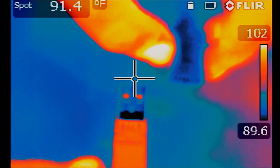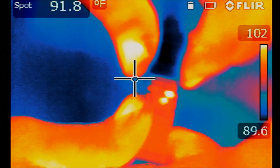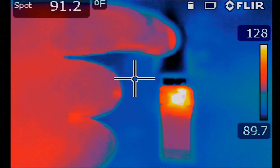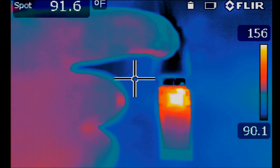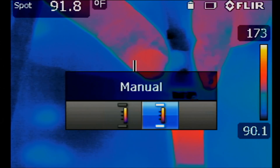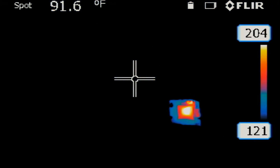What I want to do now is test the drive under a thermal cam to see if we see anything obvious. Okay, so let's plug it in. And look at that — we see two hot areas: the controller itself and a capacitor that's beside the controller. That's not normal. The controller should get hot but not the capacitor. So I'm thinking there's something going on with the capacitor.